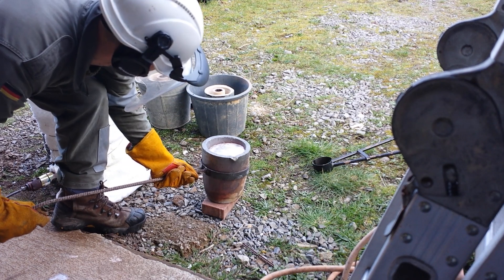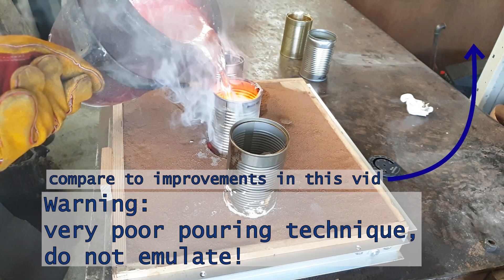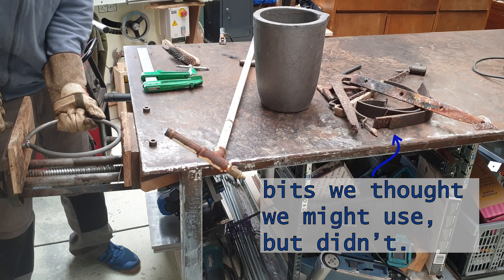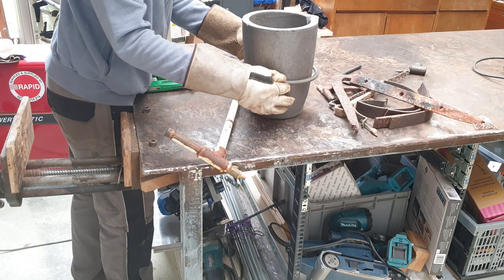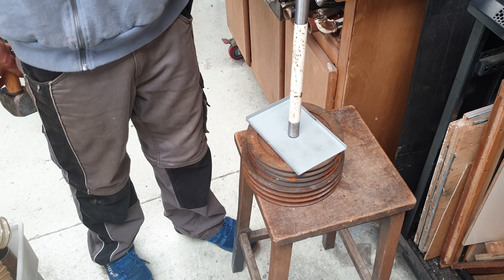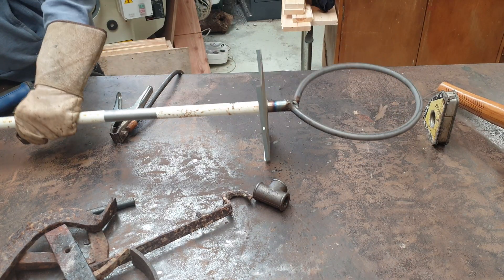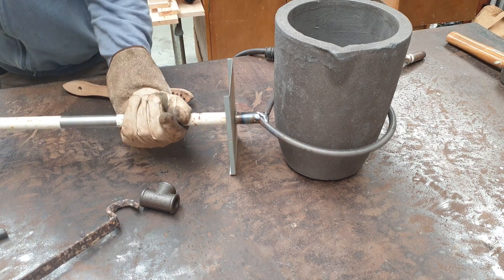I think that's going to work for taking the crucible out of the furnace — now we just need some way of pouring it. I've used a sort of loop tool in the past and that's always worked quite well, even if I have used it in a misguided way, so let's have a look at making something like that. It would be nice to have some kind of ring roller, but this hoop — just like all the other curvy bits of metal in this project — was made by wrapping around a certain size cast iron pulley. The new crucible is not actually perfectly circular, which is why I was adjusting with the vise. The hoop is attached to yet another bit of scrap pipe, which has this little bit of scrap sheet metal hand-guard that will hopefully stop my gloves overheating quite so much next to a massive pool of very hot aluminium.